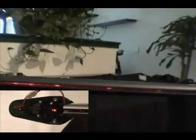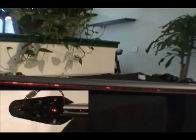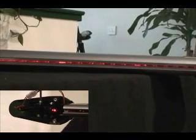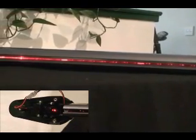Once the laser line is on the red lens, usually a couple small adjustments must be made with the green screws to reach optimal sensor values. When complete, the laser line should be hitting all 32 sensors along the post arm.